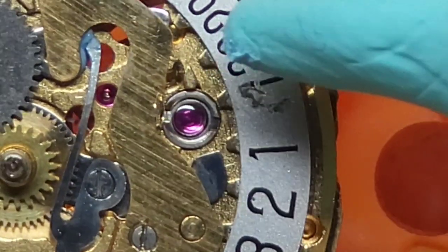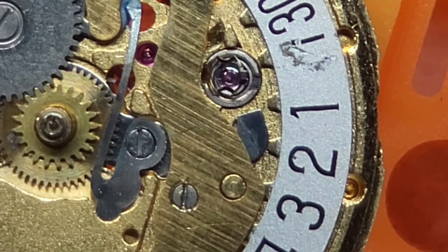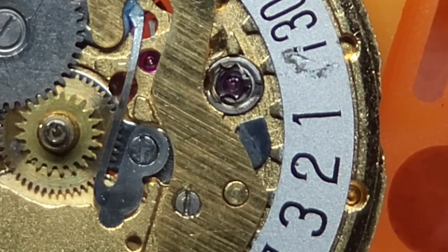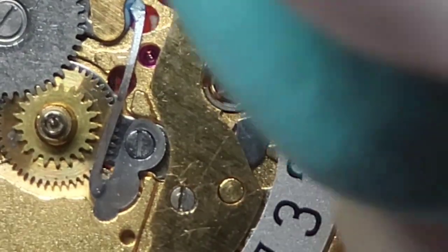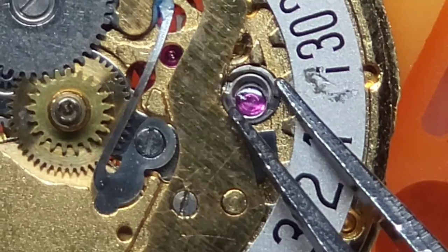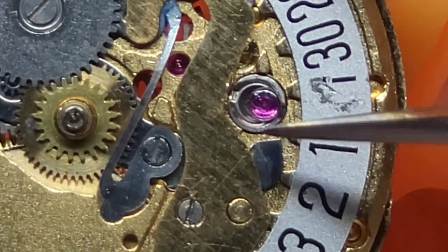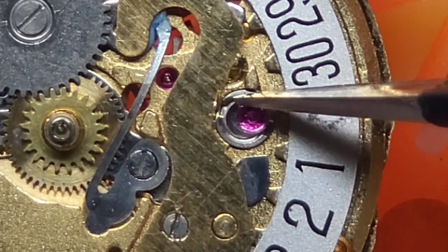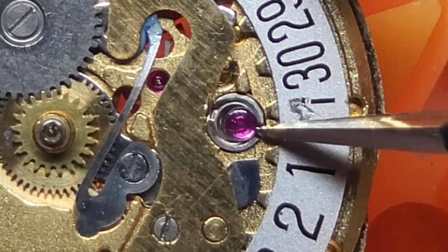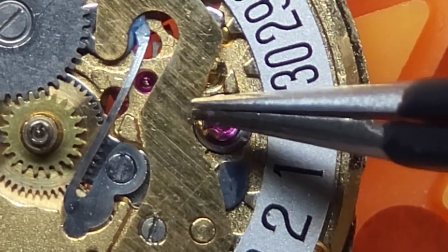Another comment from one of my old videos — and a very appreciated comment — was that it's not a good idea to put a pallet fork in an ultrasonic cleaner. The reason given is that there is a shellac which holds the jewels of the pallet fork, and the ultrasonic vibration could cause the jewels to come off, which would have ruined your day. I can kind of see why — it's quite a strong vibration being sent through. I thought the ultrasonic cleaner was actually very very mild. But as we are going to find out later in the video, mild is not a thing that it is — it's actually quite abrasive when it wants to be.